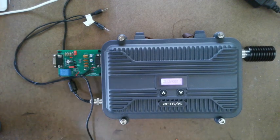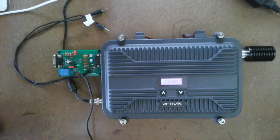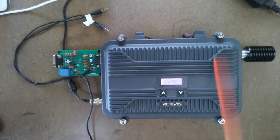There's no sense doing the software if we have problems with the hardware. Just to refresh your memory, this is the RT97S repeater. This should also work with the Midland MXR10 repeater. Those two repeaters have a data port on the side. This interface board plugs into it and lets you hook up a computer to your repeater so that you can run date and time, Zello, and weather announcements over the airways.